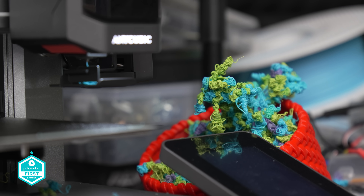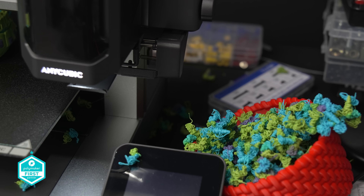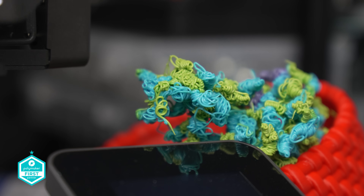Which really brings me on to one of the biggest annoyances with the Kobra 3. This isn't just a multi-colour machine — it's a snot-chucking rocket. This thing has a magnet on the end of basically where the nozzle comes, and it actually wipes it and chucks it across the room. It's enormously powerful and brings all these tiny little bits. We've seen this before with other manufacturers, especially with Bambu Lab, and it's one of the biggest problems with those machines. The amount of waste you generate can't be easily recycled at this point in time. It's a real challenge, and this isn't really innovative enough to make any changes. Even in the slicer, if you dial down the waste, it still isn't enough — in some of the test files it actually generated more waste in weight than the model itself weighed, which simply doesn't make it cost effective.